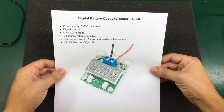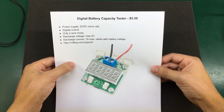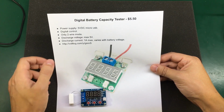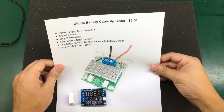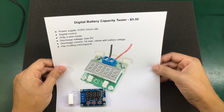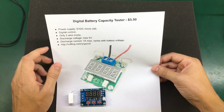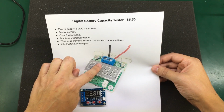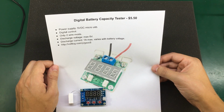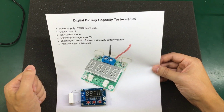There is also another resistive dummy load model on Banggood. Here is a picture of it. I think it's pretty similar to this one. It does the same thing by switching the resistor across the battery while measuring and logging the current. I guess the advantage of these resistive loads is that you can get down to small currents under 100 milliamps. However, this second one is very limited with just 5 volts maximum discharge voltage and no adjustable cutoff voltage. Anyway, there will be a link to both of these in the description below.